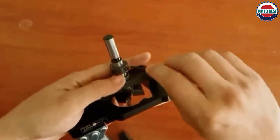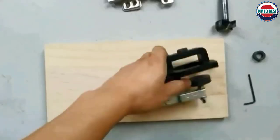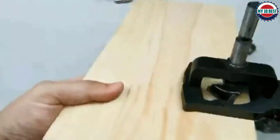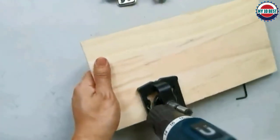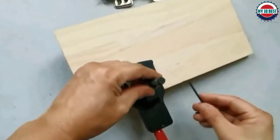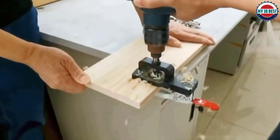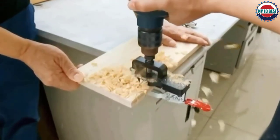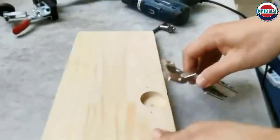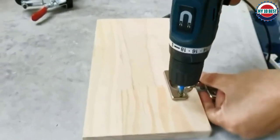The hinge drilling jig is a DIY woodworking tool. The adjustable dial design is limited to 3, 4, 5, and 6 millimeters — very accurate and convenient to use. The hidden hinge clamps are available for 46mm, 48mm, and 52mm hinges and can also be used with any drill bit. This concealed hinge jig is suitable for boards with a thickness of 15mm to 25mm, with drilling depth adjusted to 12 to 13 millimeters normally. It is fixed on the workbench by quick fixing clips on the adjustable pressure plate and base bracket.